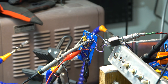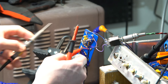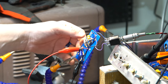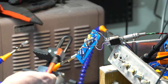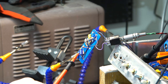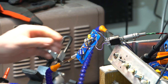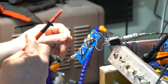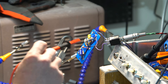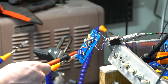That makes me wonder — let's go ahead and turn this off. I'm going to review the schematic and see if there's something we're doing wrong. I'll temporarily disconnect this board and rotate it around, with voltage turned off. One thing I'm seeing is this is the input point, which normally had about 250 to 300 volts. It jumps across and drops down to about 8 volts. The 8 volts may be because it's drawing so much current. That component looks a little heated — maybe I just got the soldering iron close to it. I'll follow the lines of the schematic and talk through it.